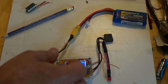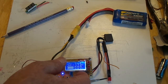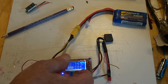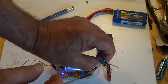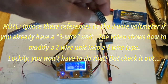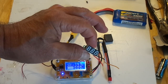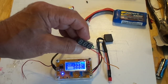Using the bridge rectifier will result in a little voltage drop on the other side of the diode — at the aircraft's capacitor. So we want to put a voltmeter on this charging lead to monitor the actual charge going into the airplane. The drawback to using the two-wire voltmeter as-is is that it's also powered by the voltage it's sensing, so it only works down to about 2.5 volts. When you're charging, you don't see any indication on it until you hit about 2.4-2.5 volts.